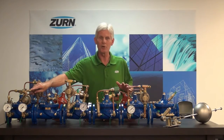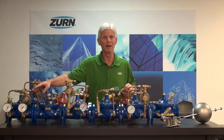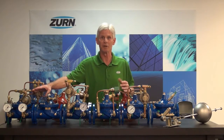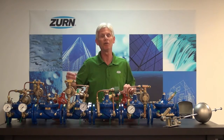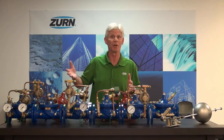Based upon this valve we do have a number of offshoots. We have, for example, the ZW209Q. That valve is a pressure reducing valve but it also has downstream surge protection. In the event the downstream equipment shuts off rapidly, we could have a very strong rise in pressure downstream. The ZW209Q will sense that rapidly and close the valve off to prevent that downstream potential surge.